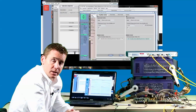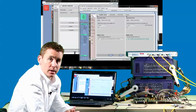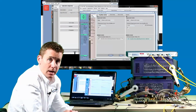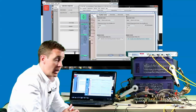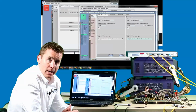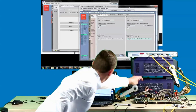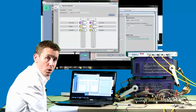Before I move on and examine these time slots, I mentioned earlier that the JDSU box is only capable of generating a single 10 gig client within a 100 gig payload. It's also only able to produce an STM64 client, not 10 gig E at this time. So we'll use some other markers to identify the 10 gig E client, but I'll also enable a loopback at the OTL layer, which allows us to loop back the transmitted 10 gig E client to the receive side of the 10 gig E test box. And as I do this, we see the 10 gig E tester showing all green.